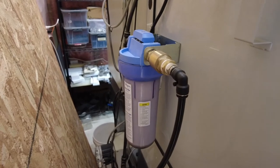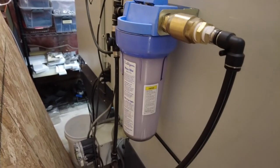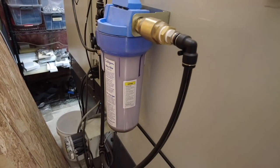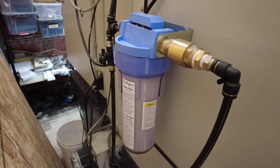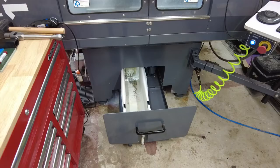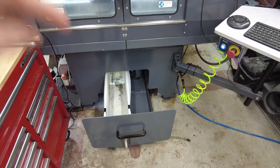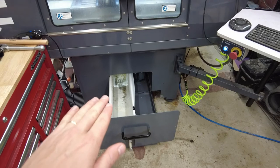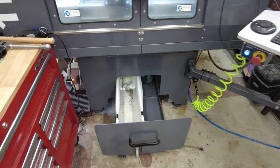That is only the first-stage filter that prevents stuff from getting to the pump. I also have a whole-house water filter — I believe this is taking it down to 10 micron — inline between the pump and the spindle, so I also have pretty good filtration there. I did a quick test on this filter felt and all the coolant was going through perfectly. I was a little worried it was going to slowly back up on me, but with the 25 micron, it seems to be working good.